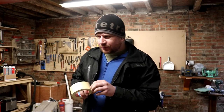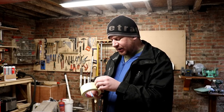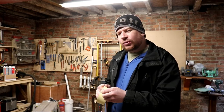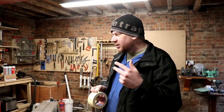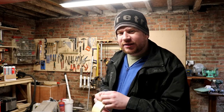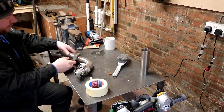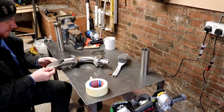And what I'm going to do is use a copper manifold to start off with, because as I said the other day, I will probably build another mash tun in 6 months or a year's time. So an old school copper manifold will be cheap, it will be easy to manufacture, and it will see us through a pinch. I don't want to be buying expensive perforated stainless steel sheet to put in the bottom and then we scrap the mash tun. Waste of money.